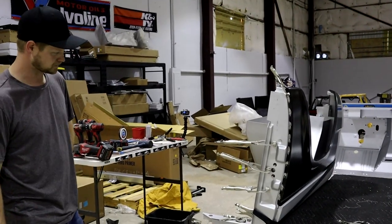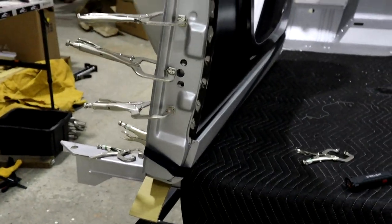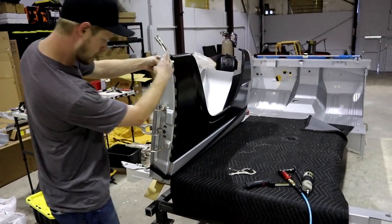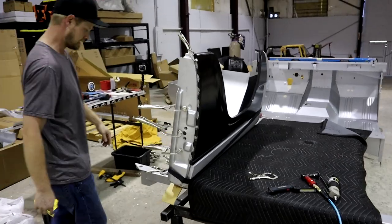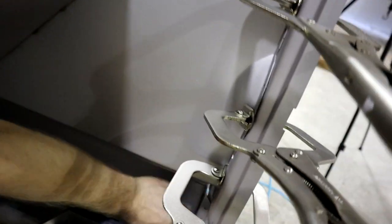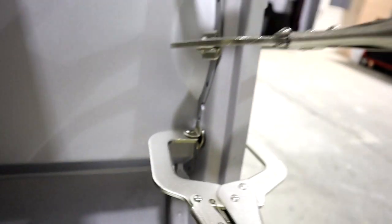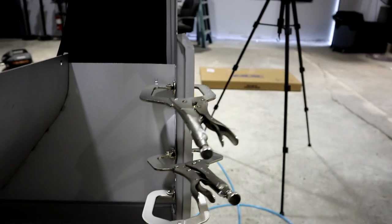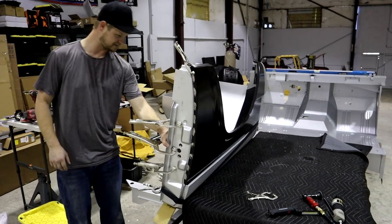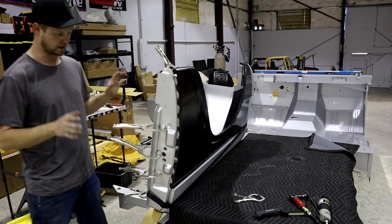We're getting a little closer — it's about time to weld. As you can see, we have a ratchet strap wrapped all the way around it, stuck everything tight where it needs to be, just a couple of clamps holding it where it needs to be. But all the lines line up. Inside here is the support bracket — that holds exactly where it's supposed to be and it is in there perfect now. We squeezed it, we trimmed it, we did everything to make it fit. None of this is ever right.